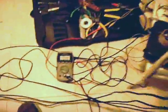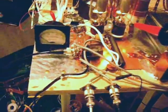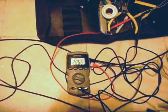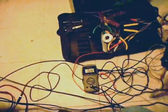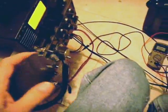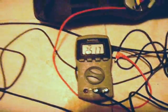Let's have a look at the B+ now. I've got my meter down here on the floor. I'll take the high voltage probe and go right there to that capacitor. Without load, it's reading about 2,850 volts. Now I'm going to try the dubious task of keying the microphone. Alright, microphone is keyed — the voltage drops to 2,500 or 2,518 volts.